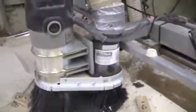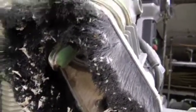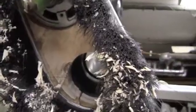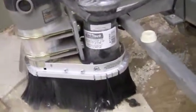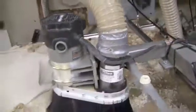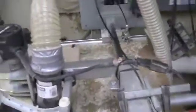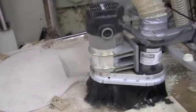On this side I've mounted a Porter Cable router. I'll just tilt the machine up here — you can see inside I've got a one-inch router bit that coincides with the diameter of the ball on the stylus. Underneath I've put on a piece of plywood with a hole in it, and onto that plywood I've mounted a three-inch door sweep and a port for my dust collection system. I've left all the dust around the machine to show you that after making three and a half tops and backs, that's all the dust that has not been sucked up — it's pulling up over 99% of the dust and makes for a nice clean shop environment.